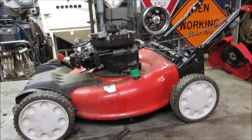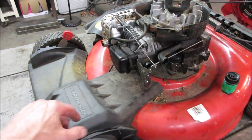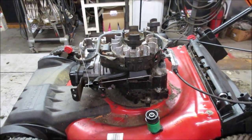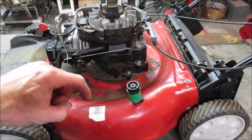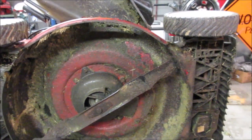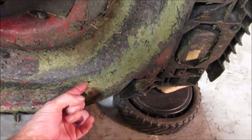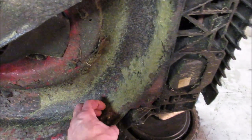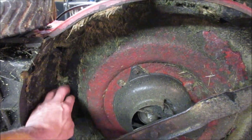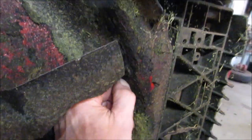Let's take a quick look at the belt that drives it. If there's no issues we'll leave it alone, but let's flip it over, look at sharpening the blade, and take a peek at the belt for any tears or rips. It definitely needs a little love under here as far as cleanliness. This is what rots the deck — grass builds up, and over the winter water stays behind it, rots the deck out from behind, starts lifting the paint. A scraper will take care of that. It's best to do right before you put it away for the season.